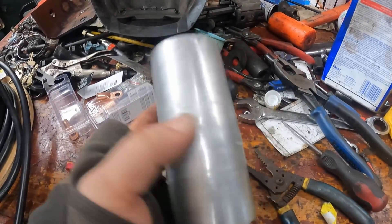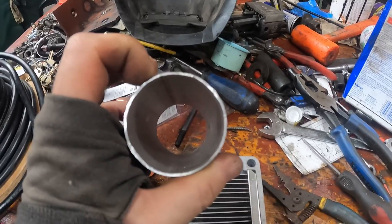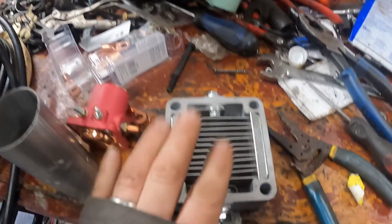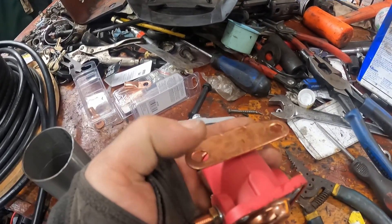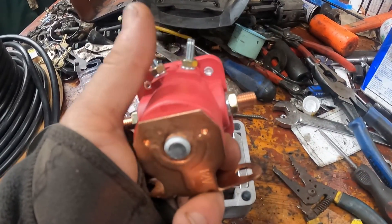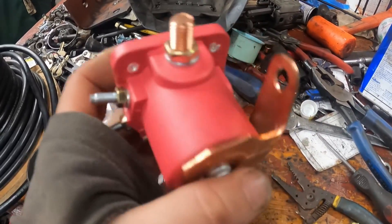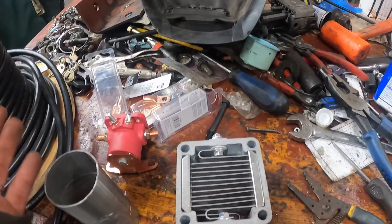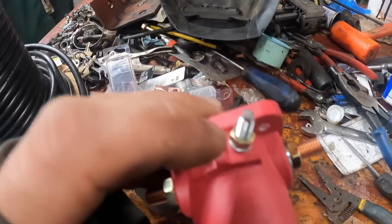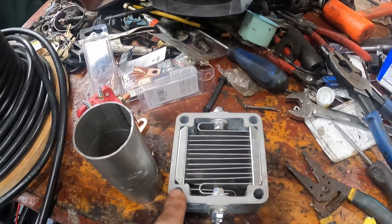What I'm going to do is take this piece of exhaust pipe — it is the same OD as the ID of the inlet tube — cut it in half, make two plates for this and bolt that in. Bolt the relay to the side of it. This relay needs to be grounded in order to work. The S terminal is the only one you need. Then put the hot wire through it. It'll go on the same side of the machine as the starter, so I've already got a big power cable from the battery there and enough room on the starter to add another lug.